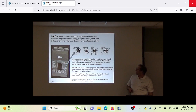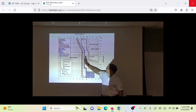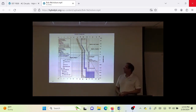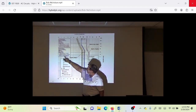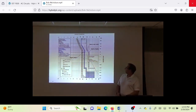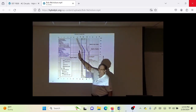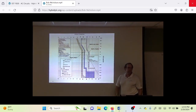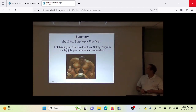There are electronic breakers that control time. Some have dials that literally, when you turn the dial, it moves this line. So we can actually change a setting on this right here by changing these pickup settings on the breaker. If we set it wrong, this line will move over here, which means that that's going to trip first. So this is the kind of thing you get in engineering that is power related. It's a big job. Somebody's got to figure this out.